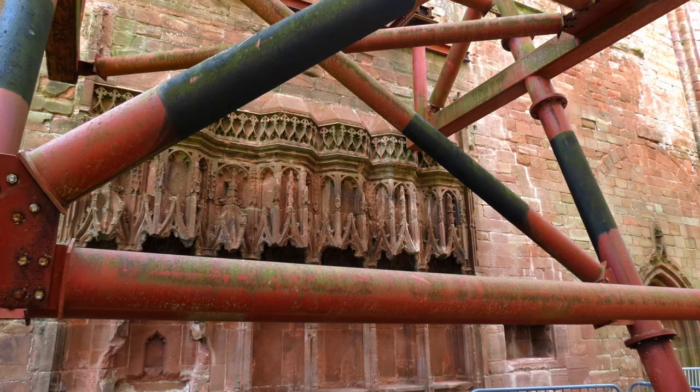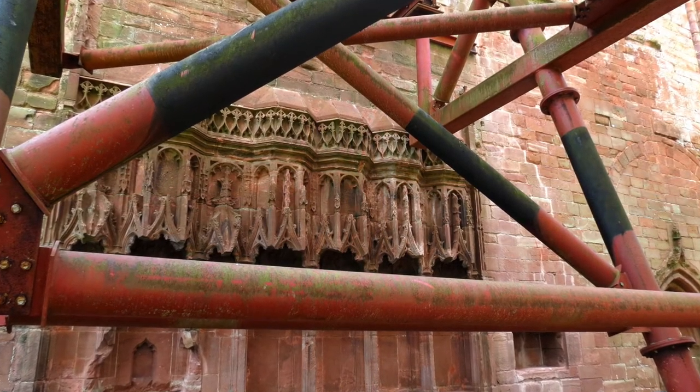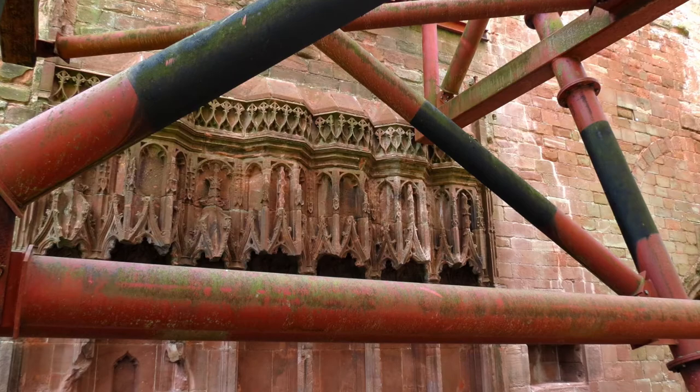So you had to have people on either side of the wall. You had to point in preparation and let the lime go off, but leave holes strategically every half a meter. I think we put them all 300 up. And then just fill it up using an unknown amount of grout, because the middle of the wall is rubble. Each skin is nicely made ashlar, which fits together very neatly, but inside, it's kind of rubble.